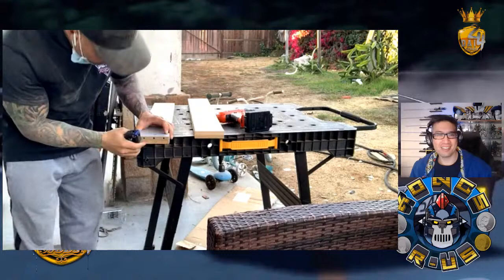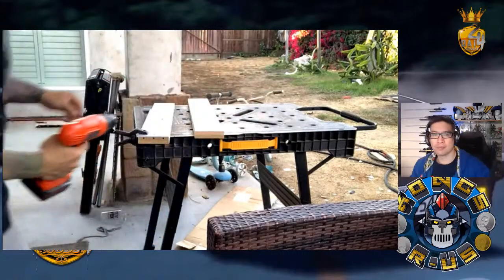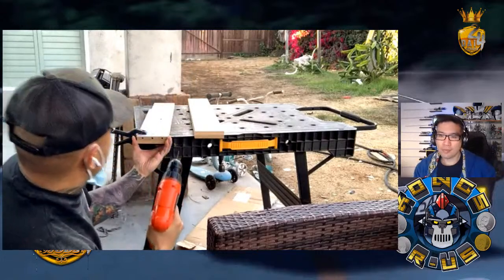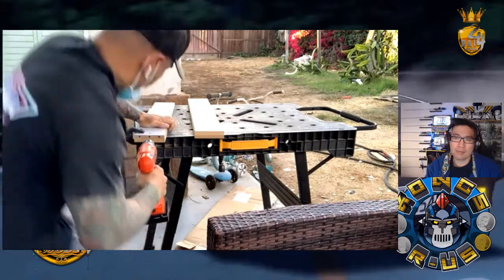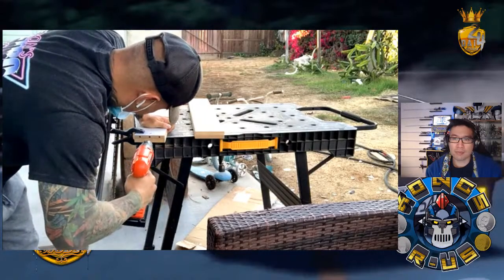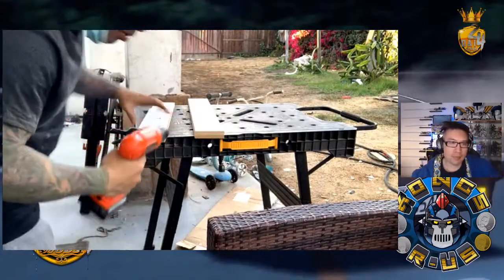Okay. Yeah. So lining up straight as possible, right? That's good enough. So I'm going to mark it. I'm going to mark it first. So the middle one has to be a screw, right? So you screw in. You just try to center it as much as you can. You get it? So I'm going to center this dead center by eyeballing it. Now I'm going to screw it in at least half an inch. How about that much? See that? Yeah. That much. Because when you do that, that way your wood won't crack when you screw the screw.